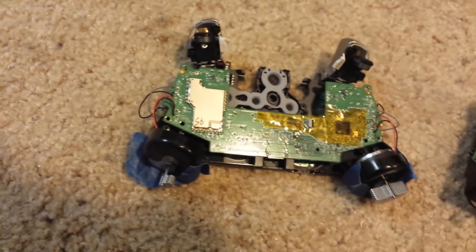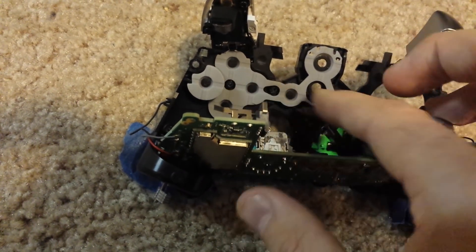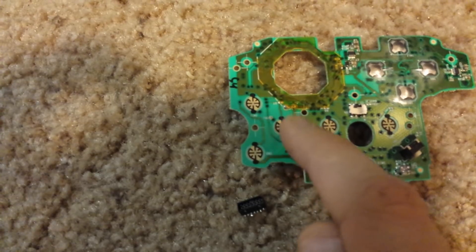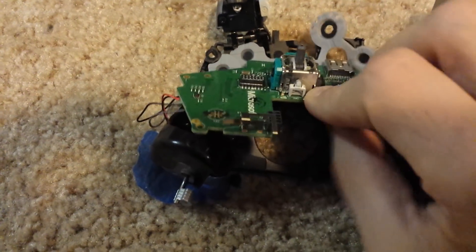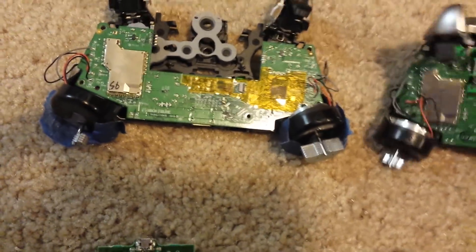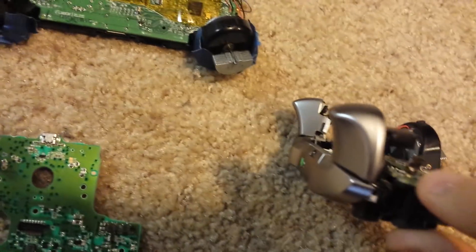The problem that comes in is the back side of this board. You can see here's where your button pads press against the board. All of these are on one plane except the B button. The B button is raised, and instead of right here where you have your A, X, and Y buttons, the B button is a separate board and it actually hits right here.